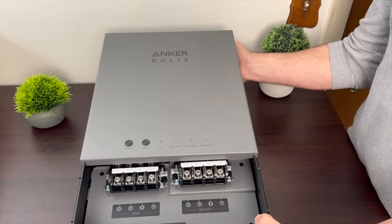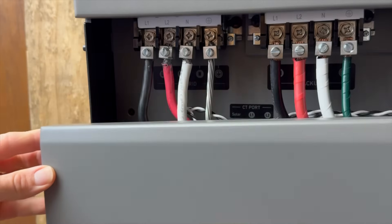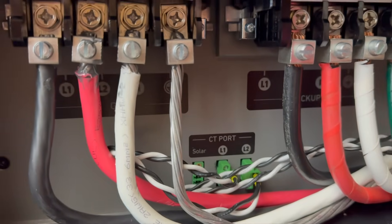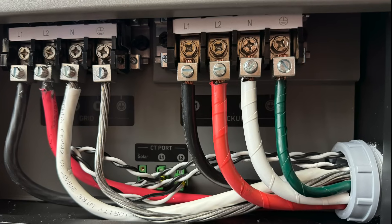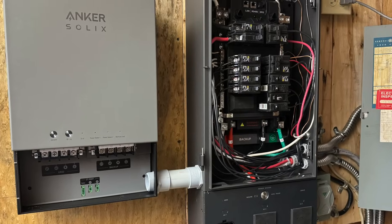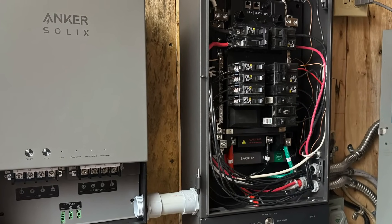It's not very big — about the size of a small sub panel — and behind this cover, it has spots for only eight wires. For the money-saving feature, you only have to use the four wires on the left, and I'll explain and demonstrate how this works. The other four wires on the right side are for a sub panel for critical loads. These are the circuits you want to have automatically powered in case there's a power outage, and I'll demonstrate that too.